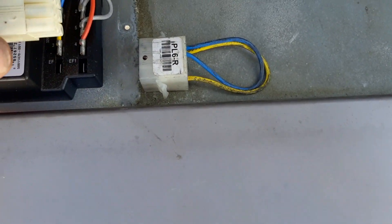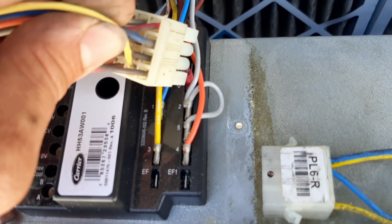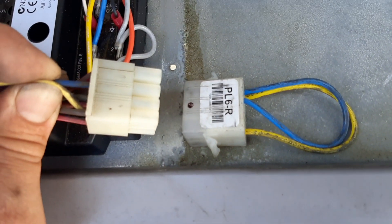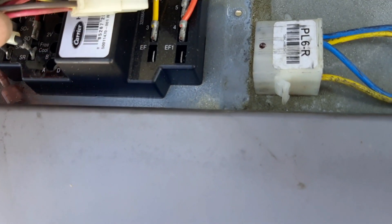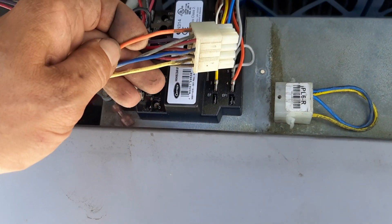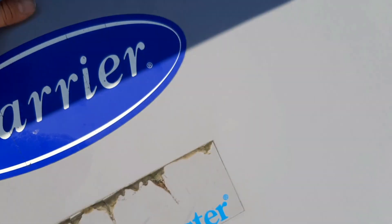This is why I like to leave these in the units if you have an economizer. We've got blue and yellow right there — it's going to jump out with that blue wire, and the yellow wire is going to jump gray. Or yellow and orange right there — we could cut these and just wire them all together. Damper did close. I killed power and just need to bring my compressors on.